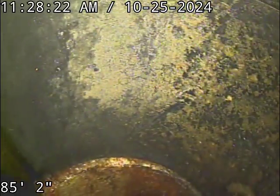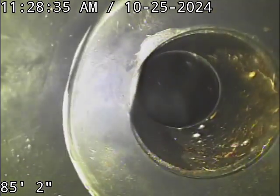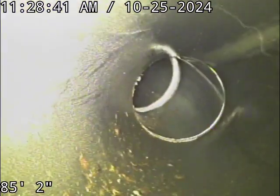We're going to go ahead and reel the camera out — actually, we're going to go backwards for just a second and stop right here. This is where the toilet ties into the line. That's also a 2-inch drain there for the shower. Nice, clean, spiffy-looking pipe going backwards there. No standing water, nothing. The line is graded perfectly — there is zero standing water in the line.